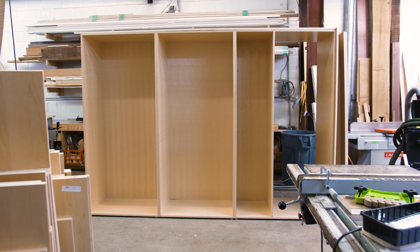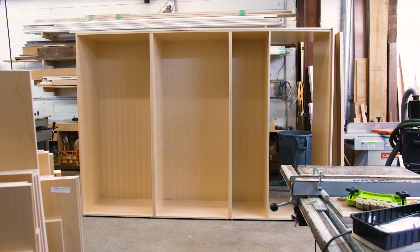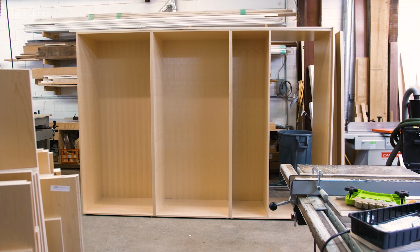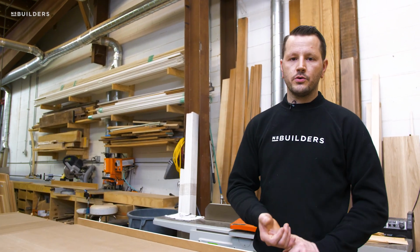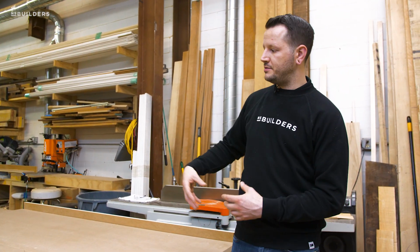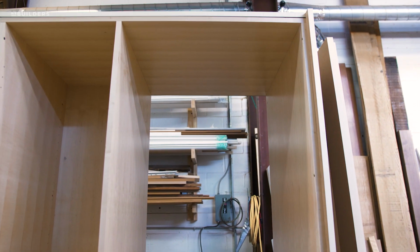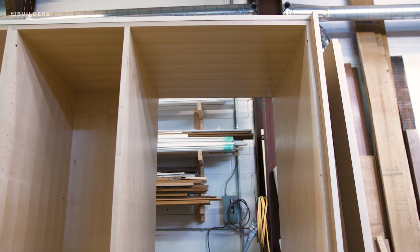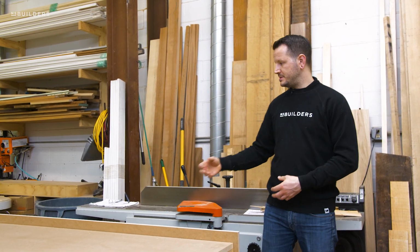But, and this is a good but, this cabinet is actually made for a secondary freezer. So we're gonna go ahead and put a full height freezer inside this cabinet. We've already done all of our research on the required space and ventilation that this cabinet requires. You saw that there was no back on this cabinet, and the reason being is so that we can vent this freezer properly.